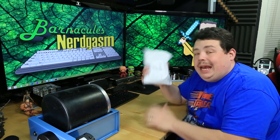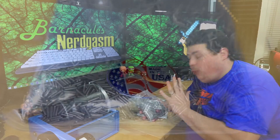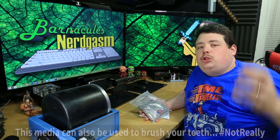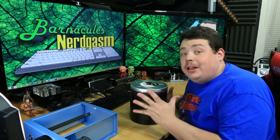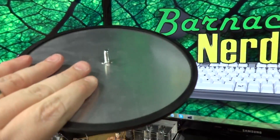Now we've got the tumbler, we need the right media for the job. I picked up two bags of stainless steel tumbling media — it never wears out and comes in five-pound packages. The cool thing about this media is it's a lot heavier, has sharper edges, and can get into smaller areas. Unlike the walnut shells, which are very lightweight and don't have a lot of mass, the tumbler constantly dropping the object into this media is going to have a much better effect.